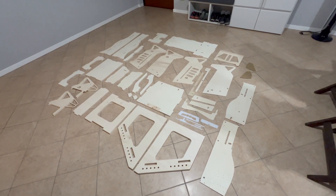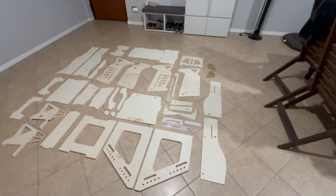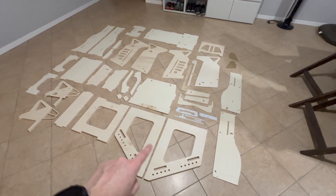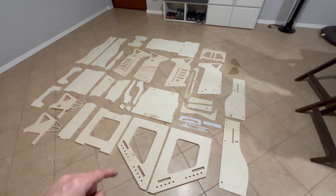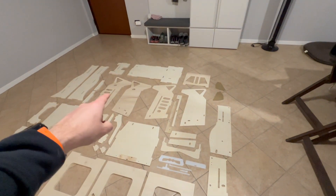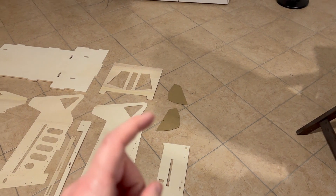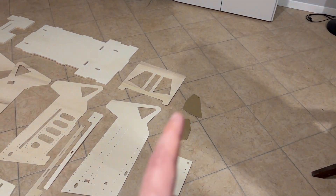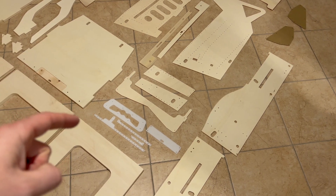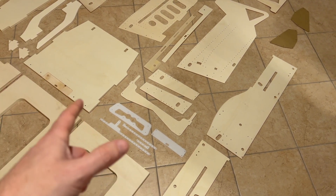This is an overview of all the pieces that have been cut by the CNC shop. These are in five different thicknesses. The plans call for 18 millimeters thick plywood for the base itself. The majority of the other pieces are 12 millimeters. Then there are a few that are only three millimeters thick, and the last two are one millimeter thick. I ended up laser cutting those out from some acrylic sheet I had, because the CNC shop cuts were not precise enough.